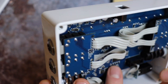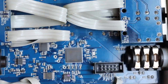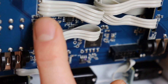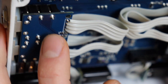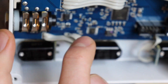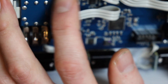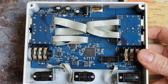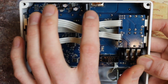Interesting to note the Analog Devices chip in use on these — that'll bring us into a broader discussion. There's a big chunk of chip there and a few other smaller ones. I did reflow some of the solder; I've seen this on Electro Harmonix pedals before where some of the solder was terrible — almost none there on certain joints. I've seen this on a Deluxe Memory Man as well, commonly on the ribbon connector joints. The jack soldering would be hand-done, and probably the caps and DC jack too.